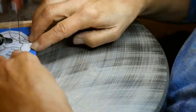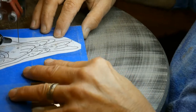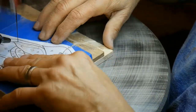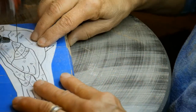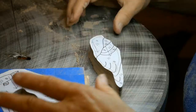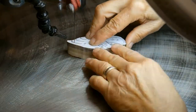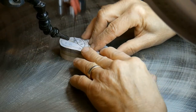Hopefully this video is not too fast. I'm showing where I'm starting on the bird — cutting out pieces from the bird and then cutting them separately. The wings are all going to be in one chunk, then I'll cut each piece of the wing separately. Using double-sided tape on the entire piece to connect all three pieces of wood keeps it from falling apart as I continue cutting the body. You can also see I'm doing a little veining — using the scroll saw blade to cut lines in without actually cutting off a piece of wood, just for an accent.